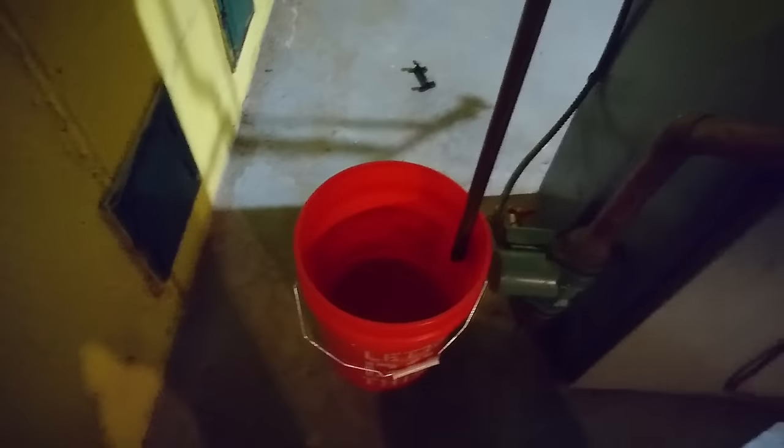My system was way over-pressurized — it was at like 20 PSI. I'm now draining a bit of water and some of the pressure out. I do have air in my system, and that's what I'm trying to take care of. A regular system with a boiler feeding one floor should be at about 12 to 15 PSI; two floors, about 18 PSI. If it exceeds the pressure, this pressure blow-off valve is just going to dump water onto your floor. If it exceeds 30 PSI — that's to protect your boiler — and that's exactly what keeps happening with mine. The air is expanding as it heats up, pressure climbs, and eventually I get water in the bucket, or if I'm really not paying attention, water on my floor.